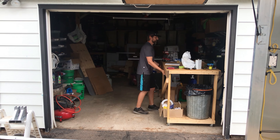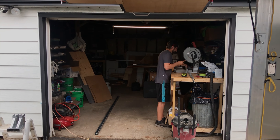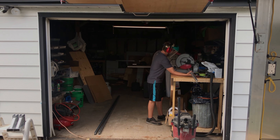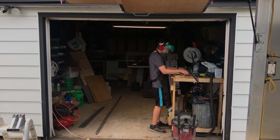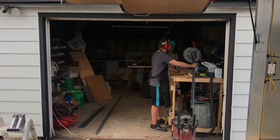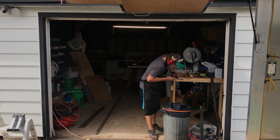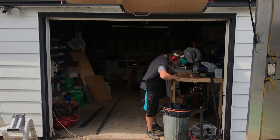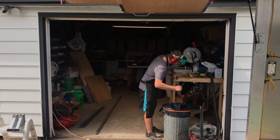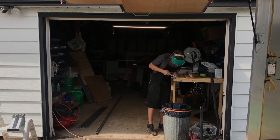I'm cutting the strut channel in half with my friend's cold-cut miter saw — thanks again John. They call it a cold cut because the tooth blade removes material producing small metal chips; any heat produced is transferred to those chips, so the material and blade stay relatively cool. The problem is you end up with thousands of red-hot microscopic projectiles flying everywhere. I grabbed an apron, face shield, and hearing protection — this thing is wicked loud. After filing the edges smooth, it was time to paint.